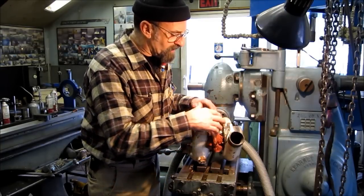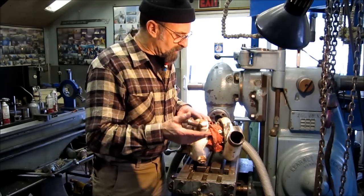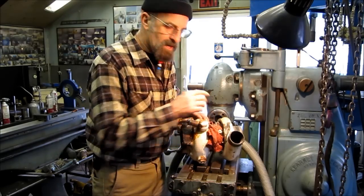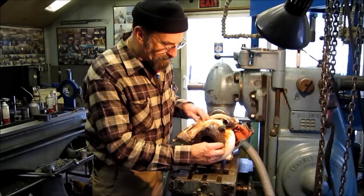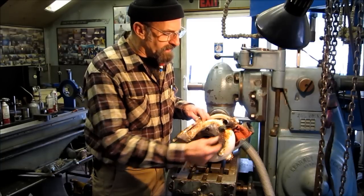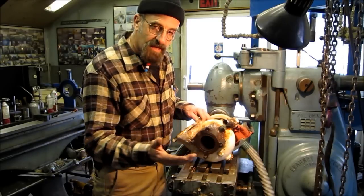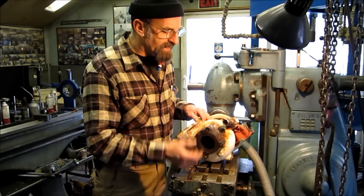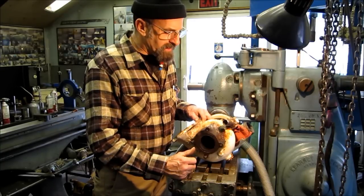So we're going to go to the plasma cutter, we're going to pick this hole center, we're going to just quickly burn out two flange blanks, and we're going to bolt those in there. And then we're going to start setting up, and we're going to go ahead and put a nut on here. We're going to heliarc that nut to that stud there, and we're going to heat the heck out of here, and we're going to take that one out, or attempt it. After that, then we're going to show you what it takes to get this mess cleaned up.